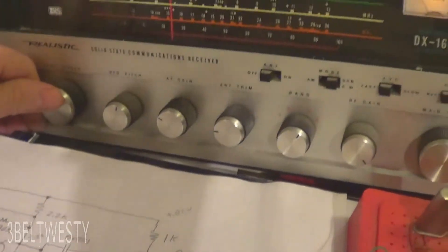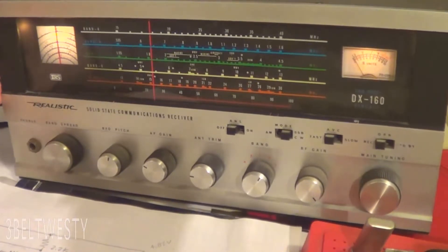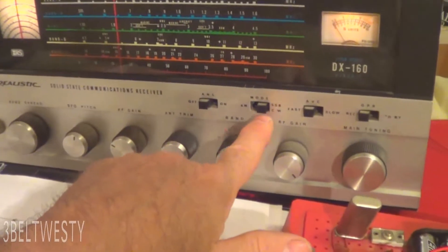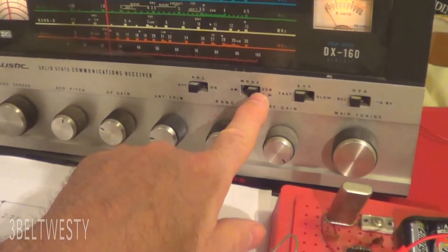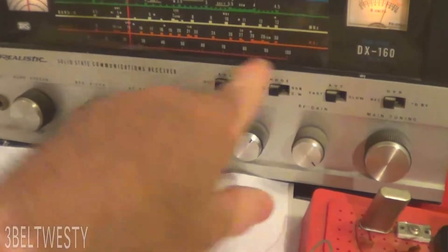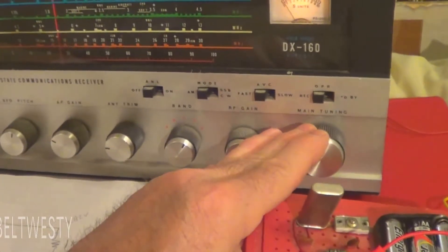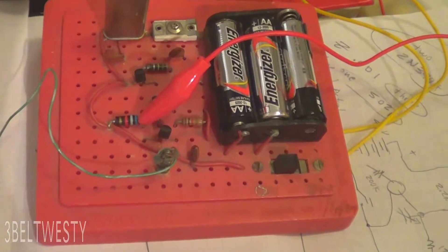It's an aid in the pre-digital era to figure out where you are on an older radio. This is a DX-160 I picked up at a swap meet for about 40 or 50 bucks two years ago. It's not all that lined up — I've got it in USB mode here so I get a little bit of a pitch off a fixed frequency. If you put it in AM mode you will get a response — not a squeal, you'll get a big blip every hundred kilohertz.